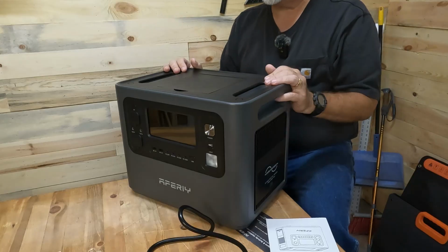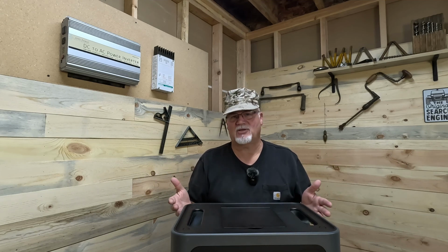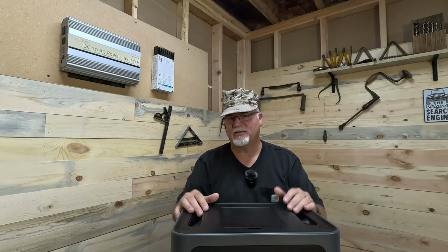My compressor runs a sustained 850 to 1,100 watt, and I mean sustained because it takes it 10 or 15 minutes to fill up the tank. So that's impressive, folks. I ran a 40-year-old skill saw to trim down the door I was installing off of this. Again, extended periods running 1,000 watts or whatever. So it will do it in spades.